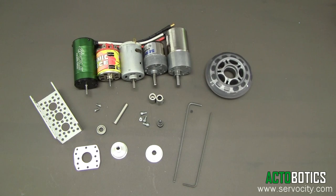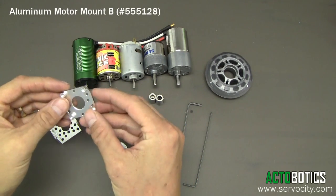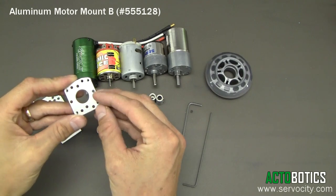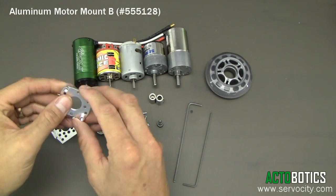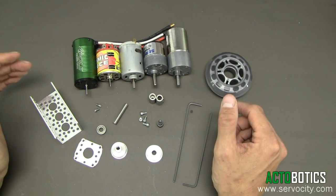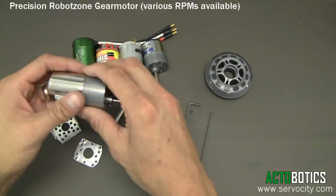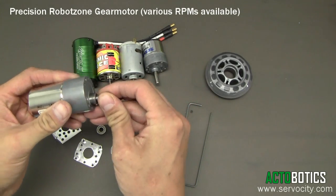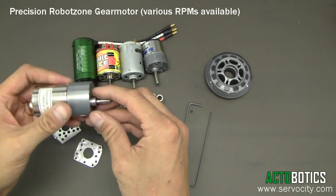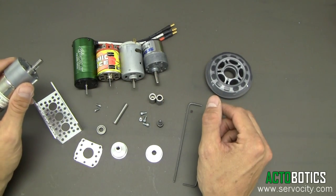In this video I'm going to show you how you can use our part number 555-128, which is a motor and/or gear motor mount. If you have a robot platform with a very heavy load, instead of applying that load down on the shaft of the gear motor or motor itself, you can put it in line and actually have a ball bearing on the end to take it.